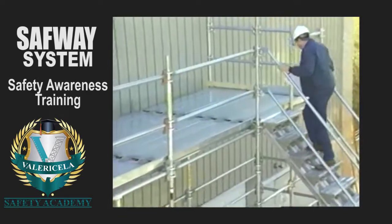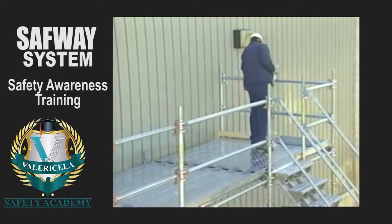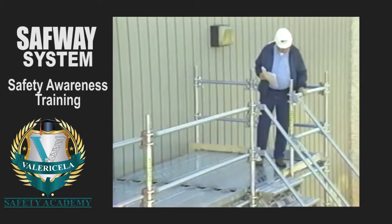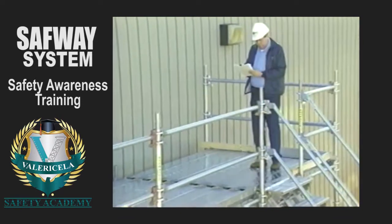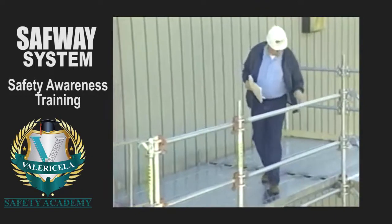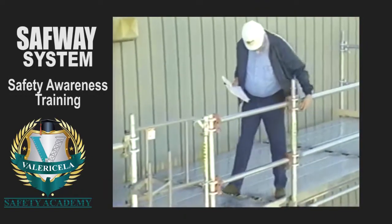Now that the scaffold has been erected, inspect it very carefully from bottom to top before any work is performed on it. A competent person must inspect all scaffolds and scaffold components for visible defects before each work shift and after any occurrence which could affect a scaffold's structural integrity.